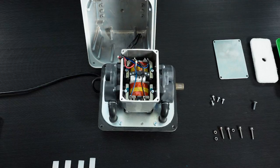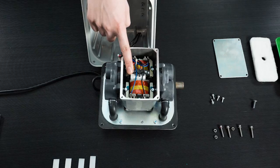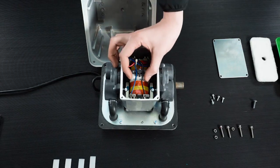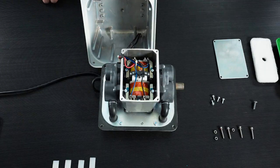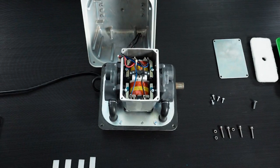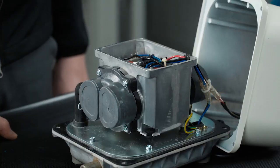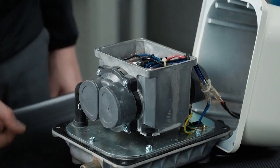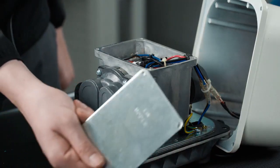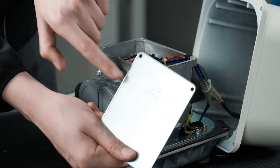You need to make sure the auto stopper switch is centralized. It might already be OK, but it's worth just checking. The switch can be pretty stiff, so if it doesn't centralize by finger pressure alone, you might want to ease it over with the flat-bladed screwdriver. If it's not centralized when you reinstate the power supply to the pump, it will not restart. Now, replace the internal core's top back down on the core casting with the imprint on the top side.